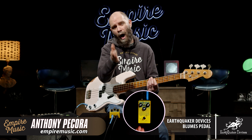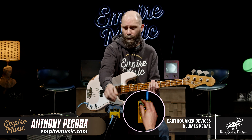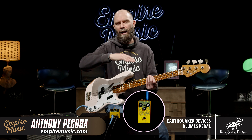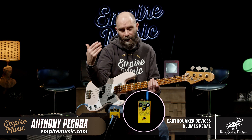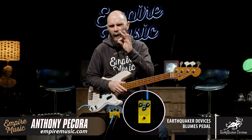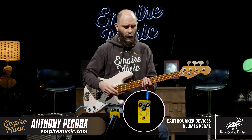Cool. That's a good amount of gain jump there. If I go right to mode two, which is the op amp with no clipping — really big gain jump. And then in mode three it's going to be a step backwards in gain. So just be aware when you jump through these modes how much gain difference you have. You go from regular, to loudest, to softest moving one to three from my experience. Let's go back to one. Got a nice unity kind of gain there from our clean tone. I'll show that again. Tone right in the middle, gain right in the middle — so we're right at the 12 o'clock setting.